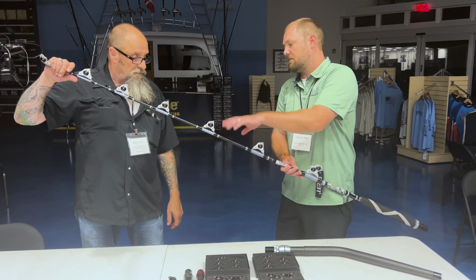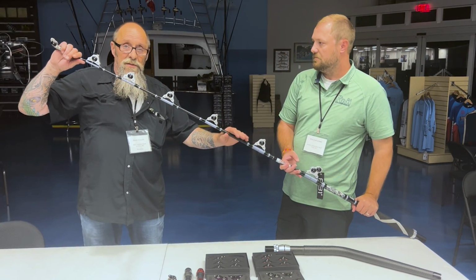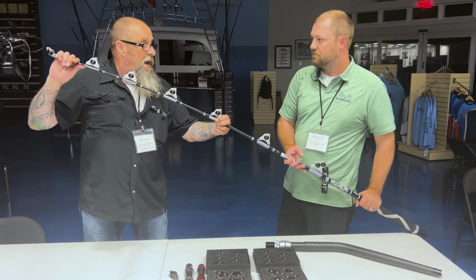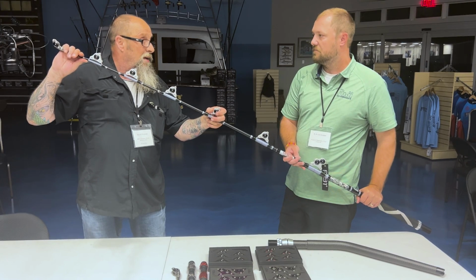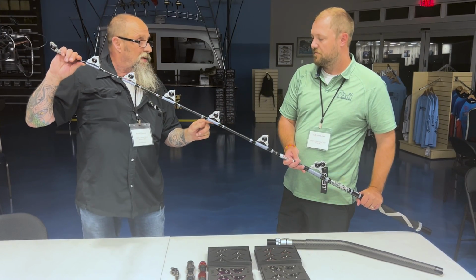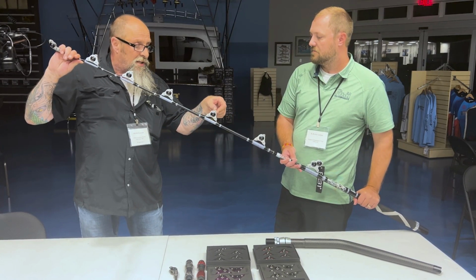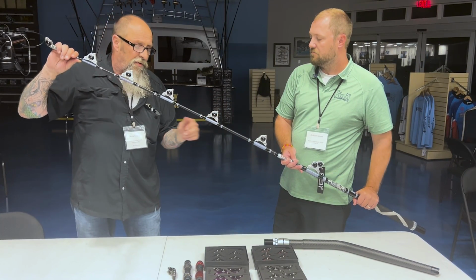So now the blank itself, does it stay round whenever it's under pressure? Or does a blank, when it's under pressure, actually deshape, turn oval? If this is solid, it cannot deshape in between because it's being held in position. This one is not being held in position. Your upper part, where your ball bearing and everything is, is actually loose on here. It's not loose enough that it's going to fall off.